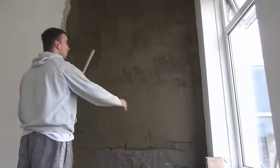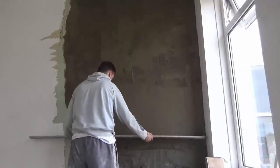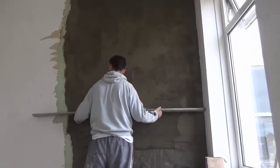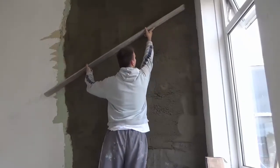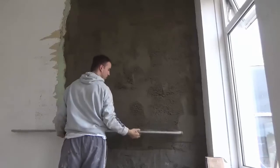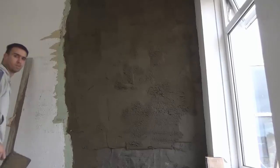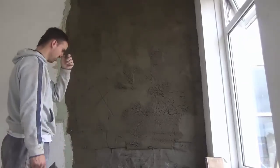I'll come back guys and show it off with a straight edge. So guys, that's my slack — there are the smooth bits. I have the paper stripped off. You just pull your rule, your straight edge, up off the original plaster, and that will bring it back to the original shape. You can sort of see when you are rendering — the smooth bits that are left at this stage are the parts you have to fill out again. The rough areas are actually out nice and flush, so they don't need any more on them. That's the smooth areas there — I'm marking them out so I know where to fill.